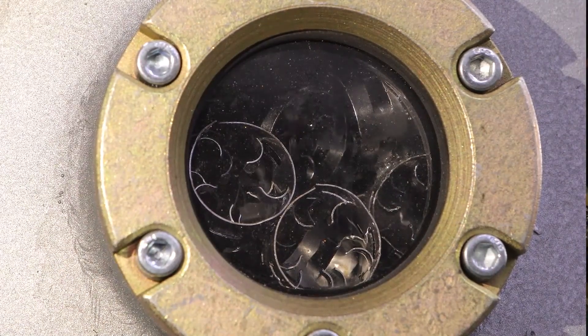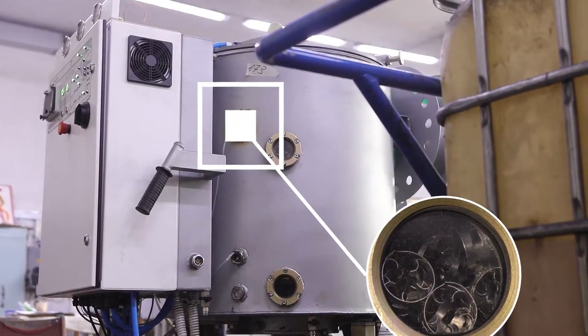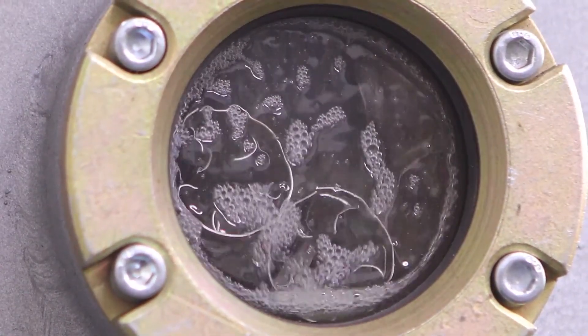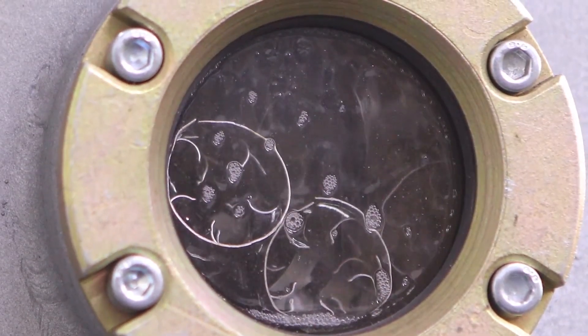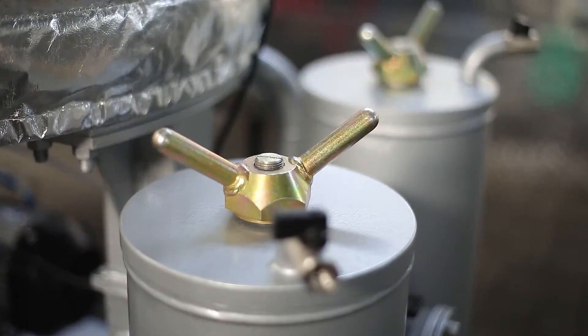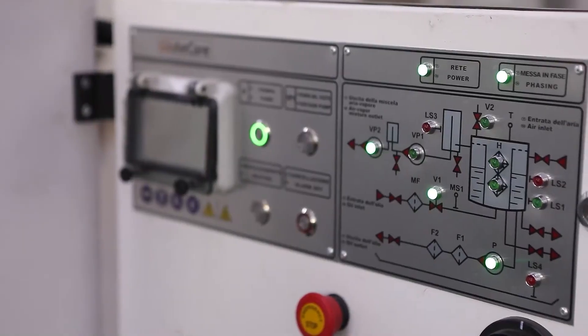The nozzles accelerate the evaporation of gases and water vapor under the influence of vacuum. There are two fine filters at the outlet — oil passes through them and is filtered finally. Complex processing allows purifying oils up to 14/12 cleanliness class according to ISO 4406 standard, and ensures residual gas content up to 0.1 percent.